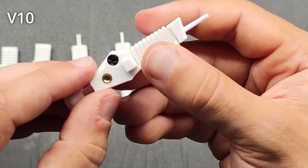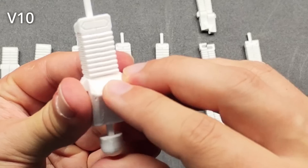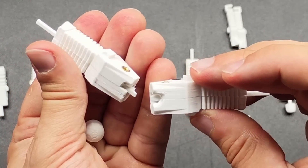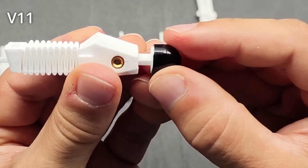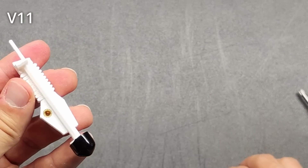The only thing left was to make it look better, so I made the screw bump edgy instead of curved. I printed six of them, installed them, then it was time to test. Unfortunately I don't have footage of the test, but it worked great on the carpet. The moment I used it on the harder floor, two of the shafts instantly snapped. After some trial and error, I finally landed on a design that worked — the shaft was basically as thick as possible, and the spring moved smoothly back and forth with just the right amount of force.